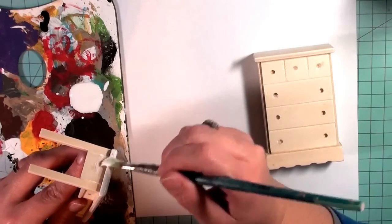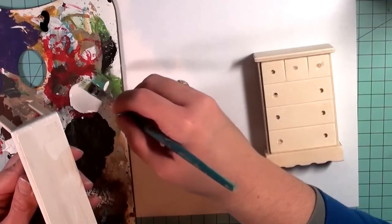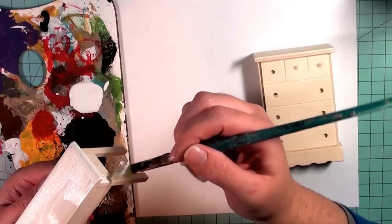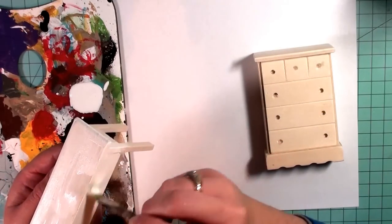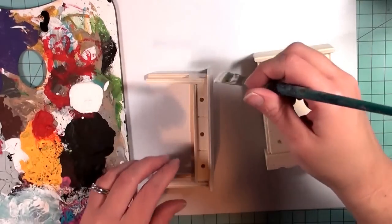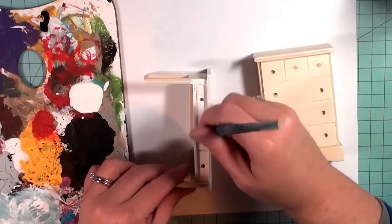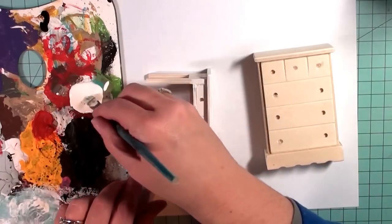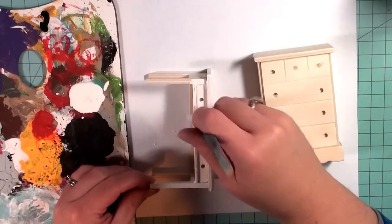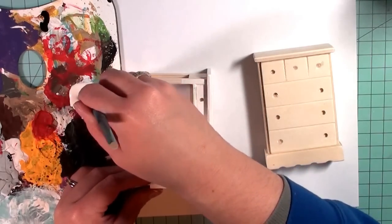and make sure that when I'm putting on any extra details, everything is already sanded how I like it and smooth, so I don't have to worry later when I start painting and there are details that I have to sand around, and that can get very inconvenient. It's kind of like, if you're a baker, a crumb coat on a cake, where it keeps the crumbs from showing up in that final layer. That's what this is. It helps raise those wood fibers that are going to raise up no matter what you do early, so that you can re-sand it and get the smoothest finish possible.